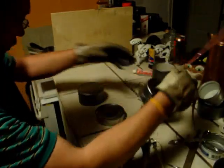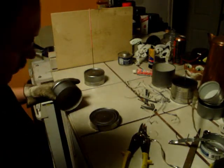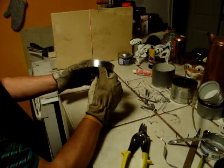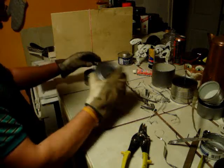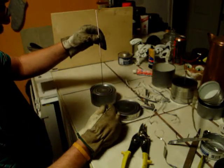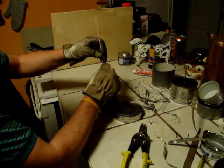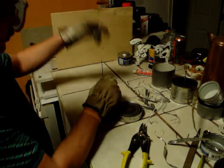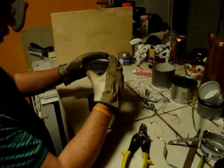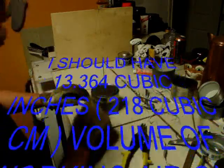Hello two-inch displacer — we're going to go here real quick. This and this is three and one eighth inches — that's what I want. This fits inside of that one — wonderful. I'll put some high-temp RTV goop on this, set it inside, and put it in the press. These little coffee stir sticks fit on these coat hanger pieces pretty good. Put a piece of super glue so you can adjust your linkage when you're done. I should have 16 cubic inches of air to play with when this is pressed.